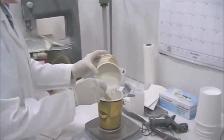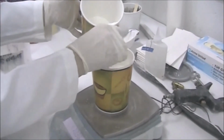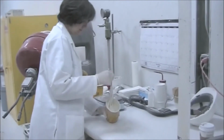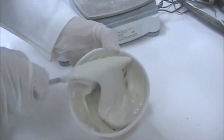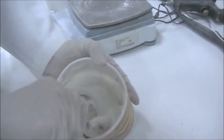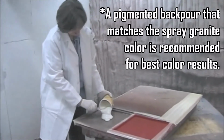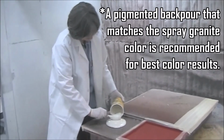The filler seen here is ProLite 50, which provides a 50% weight savings. A ratio of 42% resin to 58% ProLite is necessary for the matrix to flow well. Adding 1 3/4 to 2% catalyst based on resin is encouraged when using lightweight products due to their longer gel and cure times.